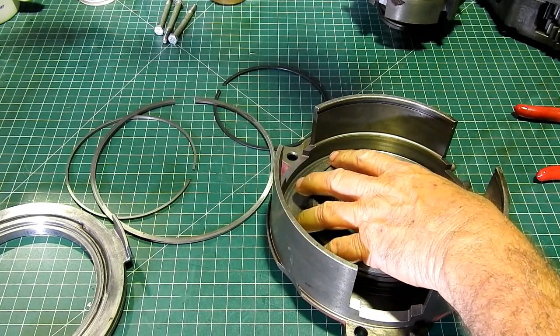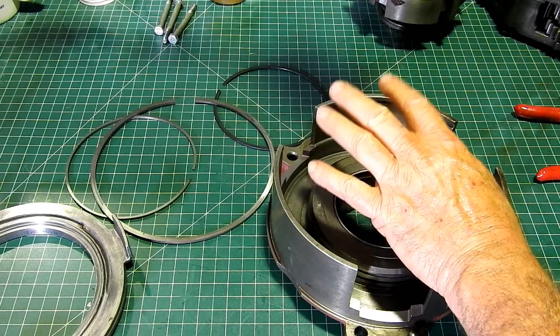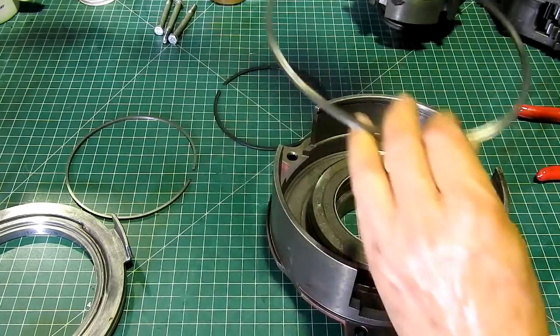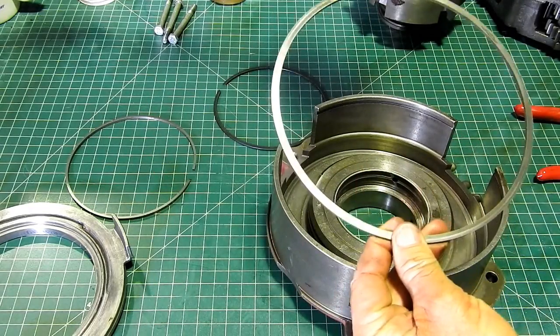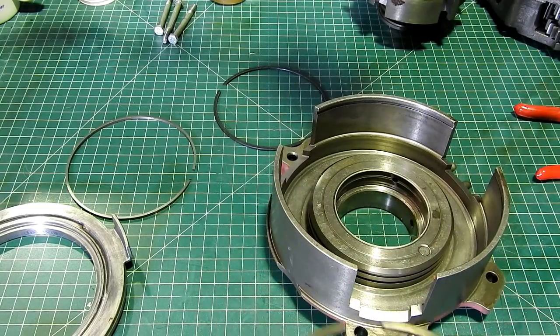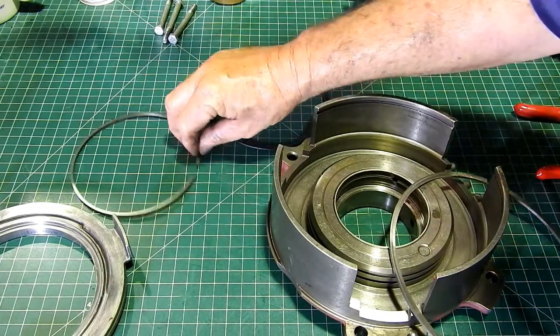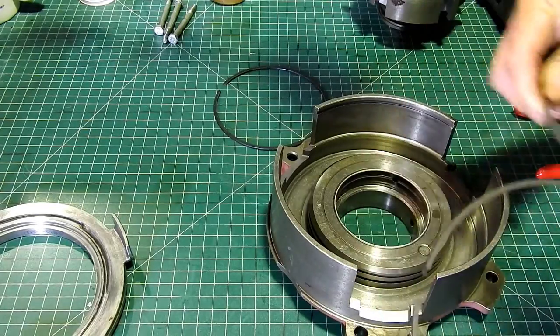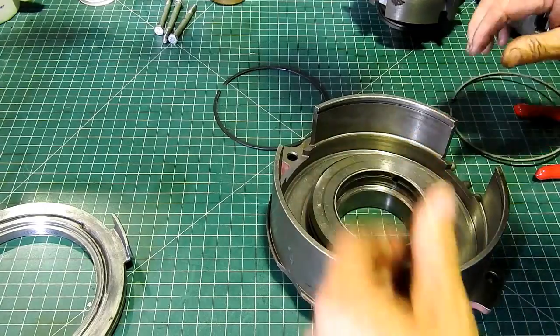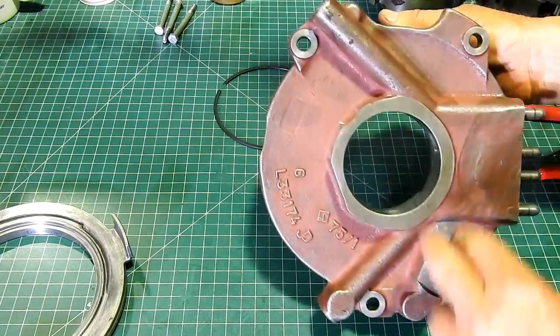Initially when I put it back together, the other O-ring would have given me a better seal, but for a shorter time. Me now, putting this tractor back together and knowing that this is in good order and I have the steel rings, that's fine. Now, I may be wrong, but in Australia, I don't believe we can buy these steel rings anymore. I think they automatically go across to the neoprenes.